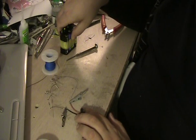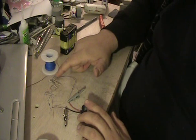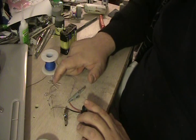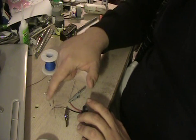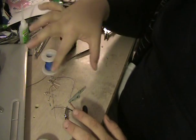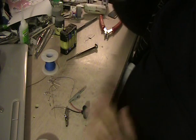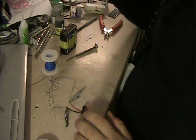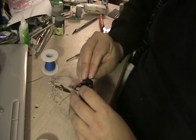So now here you can see we have our completed circuit. We have the positive terminal coming off to the positive of the first LED, then from negative to positive of the second, from negative to positive of the third, and from the negative to the resistor. A resistor — it doesn't matter where you place it; it could be between two LEDs, on the positive side, or on the negative side. It doesn't matter which direction it faces, it just needs to be there. With that all finished, now let's hook her up.